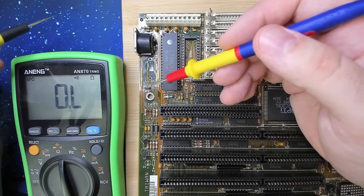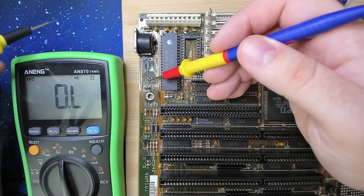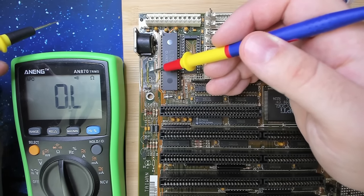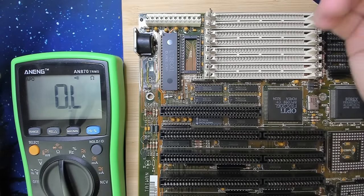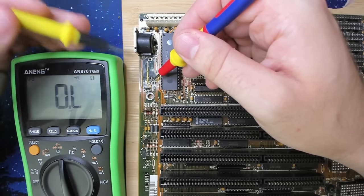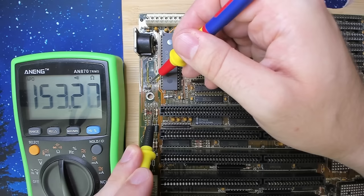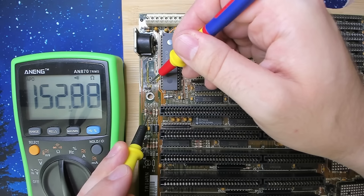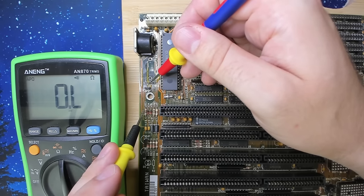We could have just not connected this wire back to where it originally connects, and instead connected it to the external battery. But in case somebody still hooks up an external battery later on and we have a button cell battery here, there would be another problem. Let's keep the board as is, so if somebody expects some circuitry to behave in a certain way, it behaves exactly as it should have originally. This connector probably goes to these components here — we have 153 ohms here, but this is not a direct connection. These two are probably connected together.